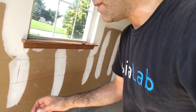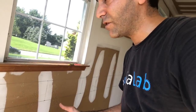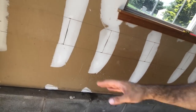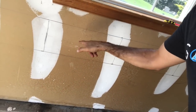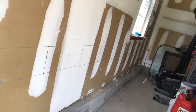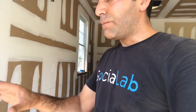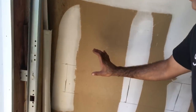My goal is to take out this bit of sheetrock all the way across, but I don't want to buy more sheetrock. If I carefully cut out this section I know how to put it back in, and spackle is not that big a deal. What I did was draw lines right on where the studs are, because that's where you want to make your cuts - you don't want to cut between two studs because you won't have a place to screw it back in. I marked each section with numbers one through eight so after you take them out you can stack them up and put them back exactly where they were.